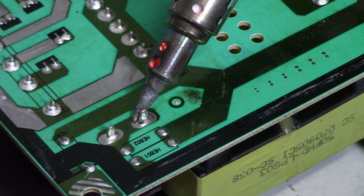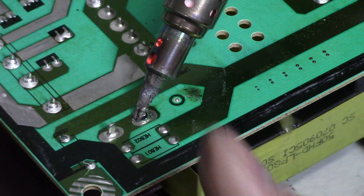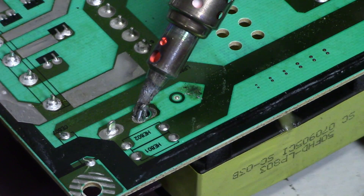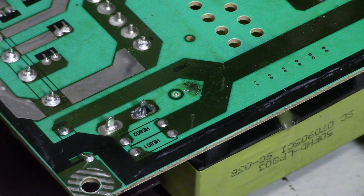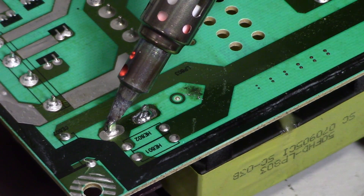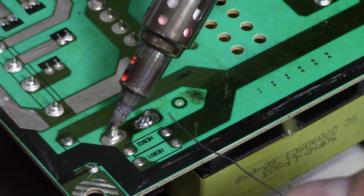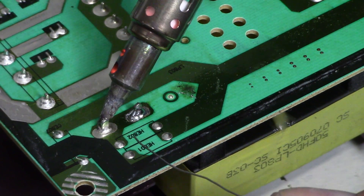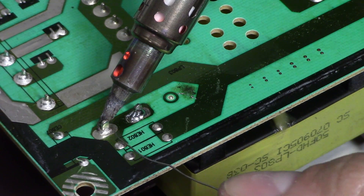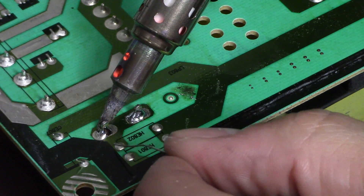Get in there, and after you heat it up — there we go. Let that soak in. Do the same thing right here. On one side, you want to press against that solder joint, that pin, and let it heat up really good. Give it a chance. I usually leave it on the middle setting — it works just fine. You just got to give it some time. And that lasts me about definitely over 30 minutes of usage.